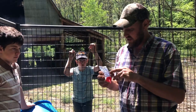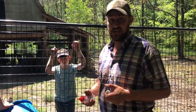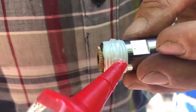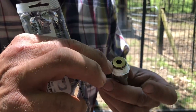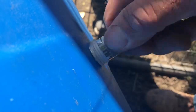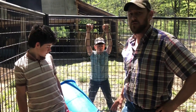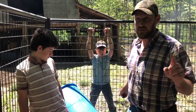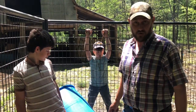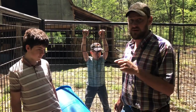We're going to try it on this. It says instantly waterproof, cured sealant is mildew resistant, paintable — the tough elastic sealant for every job. It says sticks to wet surfaces. I haven't had great success with it sticking to wet surfaces, but I've had super success with it on metal roofing. What we do not want to do is get our caulk in that groove right there because that is where the water comes through to feed the pigs. It says instantly waterproof, but we're going to let this sit in the sun for about an hour to get a good seal before we put water to it. If it doesn't work on the worst one but works on the other two, I can always drill a bigger hole and put that connector in. That's the reason I did the self-tapping method first — if one goes bad, we always have that backup plan.